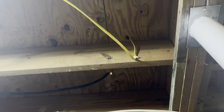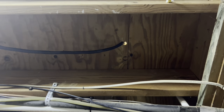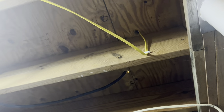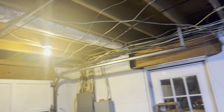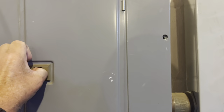When we remodeled our kitchen we moved our oven, and because we were dealing with 220 we hired an electrician to put the 220 in. Right there is the outlet for the stove, and they ran the wire over to the electrical panel. I was fortunate with that existing hole — I just measured how far I had to drill for the new wire, drilled the hole, put in several nail-in cable clamps as I went across the garage, and took it over to the electrical panel. I've got all the excess wire there; I haven't hooked it up yet.